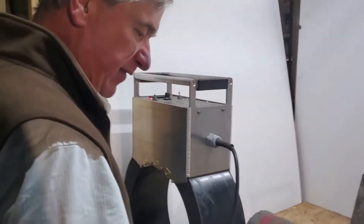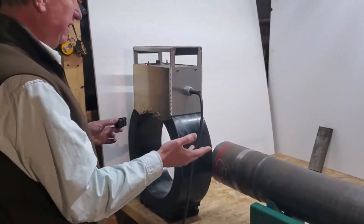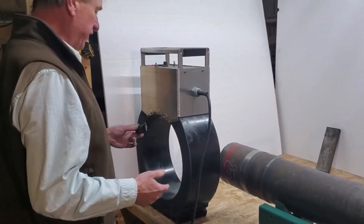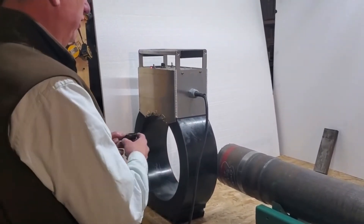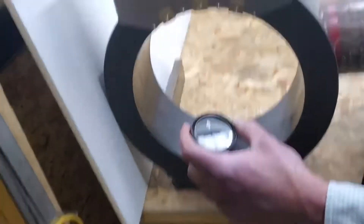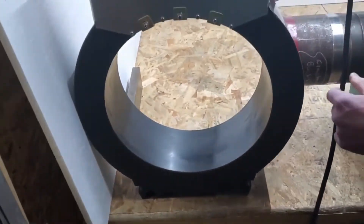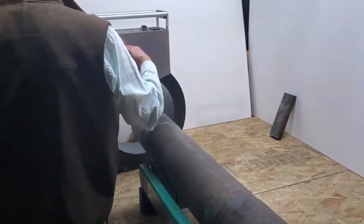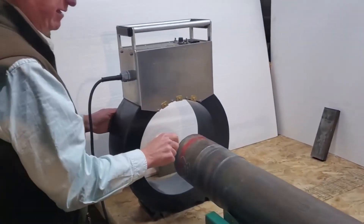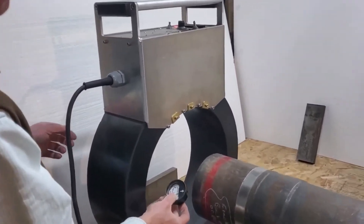The coil we've got there is a WDB-14 — it's a base coil. There's no AC and no pulsing feature on it. All I want to do is check the field direction. By changing the polarity, I've flipped the current around, so now when I press this button, this should be a positive field to remove this negative field. Here we go.